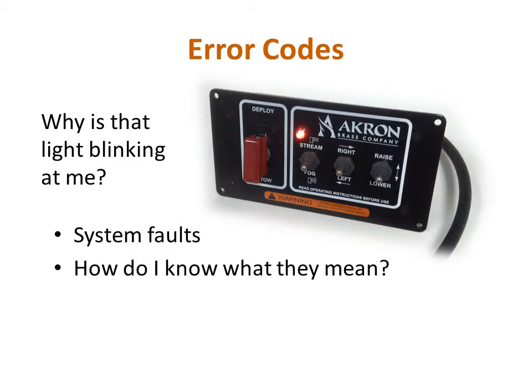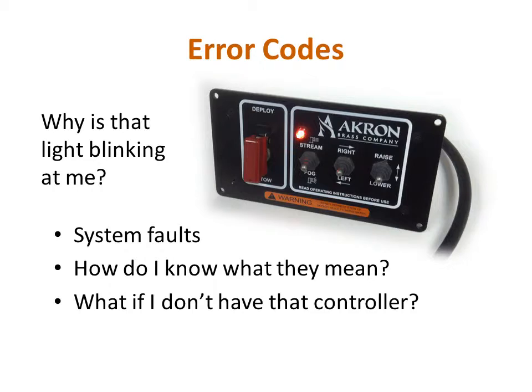The error codes cover problems such as registering an emergency stop, or the monitor not being able to rotate or elevate while trying to stow. These codes are listed individually with descriptions and suggested fixes in the StreamMaster installation, operating, and maintenance instructions available on the Akron Brass website. If you are using a system that only includes controllers without an indicator light—for instance, a tether controller with separate stow switch, a controller with six-wire stow, or a joystick—you will need to remove the cover from the logic box and look at the LEDs on the circuit board to see any error codes that are being displayed.